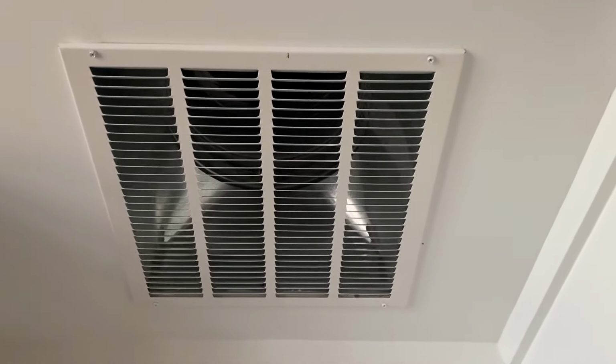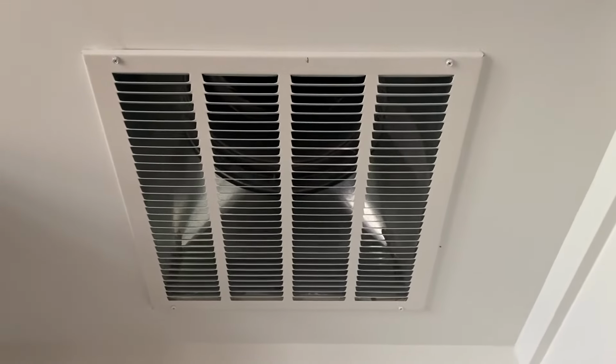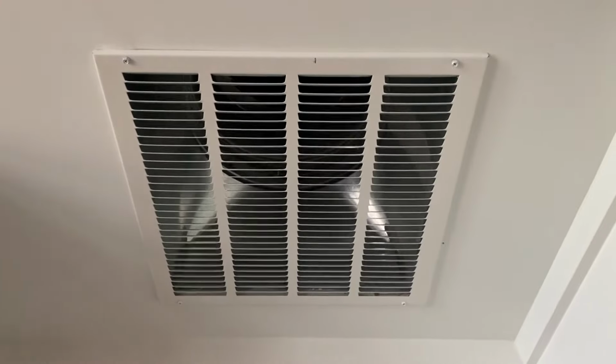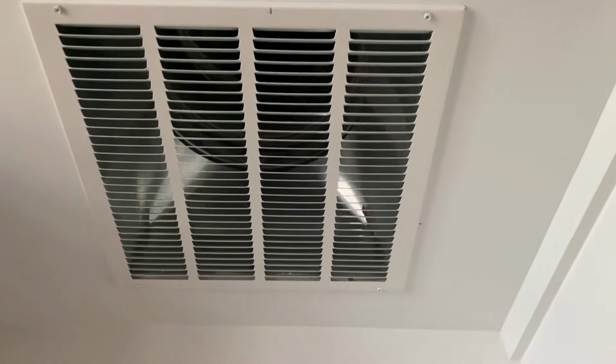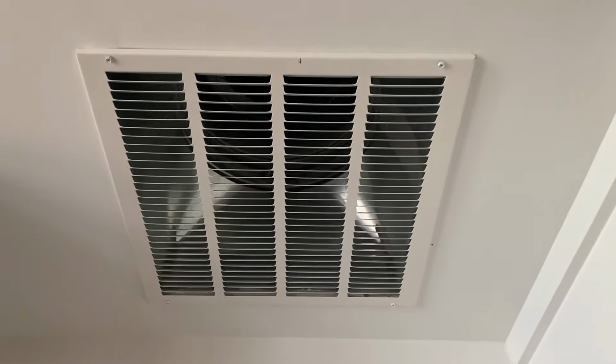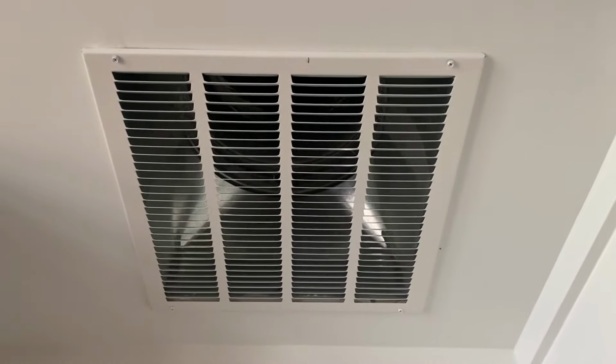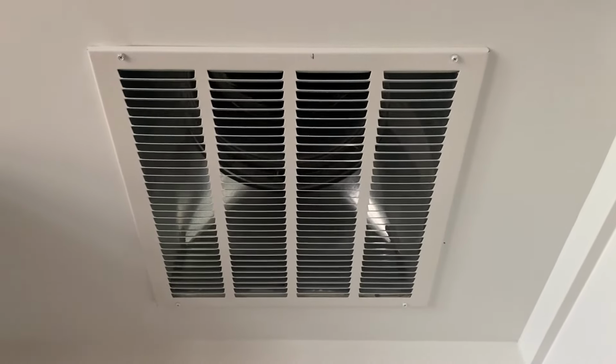Thank you for checking out our video. So what happens is due to the volume of air passing through this type of vent cover, it causes a vibration of the fins or louvers resulting in the noise. In order to correct this noise, it's necessary to adjust the fins slightly to decrease the amount of turbulence, if you will, from the air flowing through the vent.